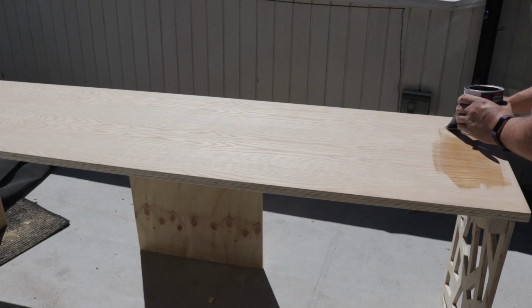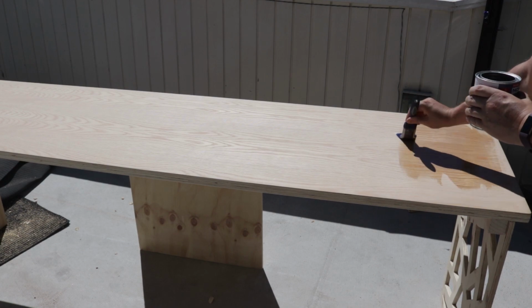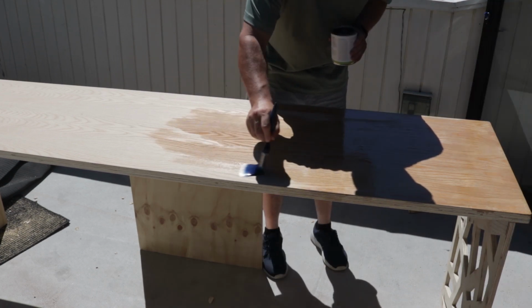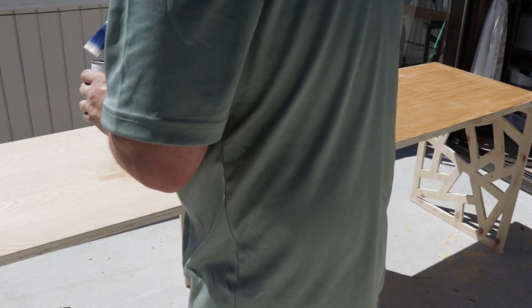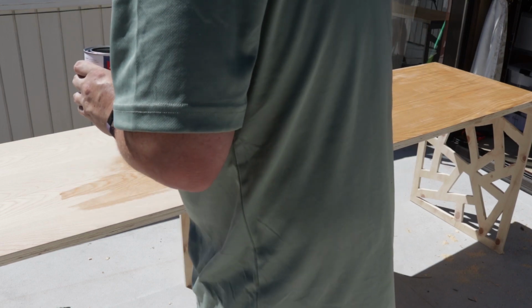Quite amazing how much the clear urethane varnish brings out the grain structure in the oak. It will mute over time, but I do plan on buffing and polishing the top of the desk, so the result should be relatively similar to what you see here. Now, this is the first coat. The particular product that I'm using that I got from the local Bunnings warehouse suggests 4 to 8 coats. I'll probably be going with 8.